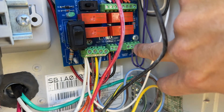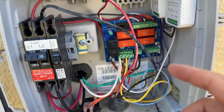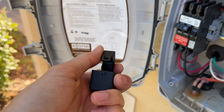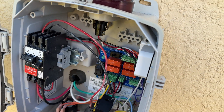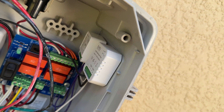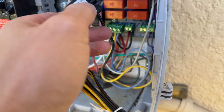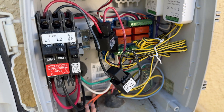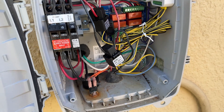I ended up connecting the dry contact to the board, connected the neutral to the common neutral right here on the board, and double-tapped the breaker for the 120-volt supply. For the CTs, all they do is clip onto the wire — they pivot, so you just put it right around the wire and clip it on. Then you plug the inputs into channel one and channel two. I need to check which is positive and negative — I assume black is negative and yellow is positive. Also keep in mind the direction of current flow — make sure the directional arrow points toward the device. I did a little loop to hang the CTs there. Now I'll pull the breaker inside, turn everything back on, and see if it communicates.